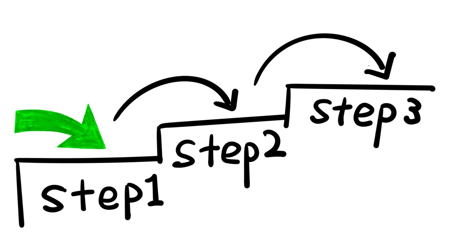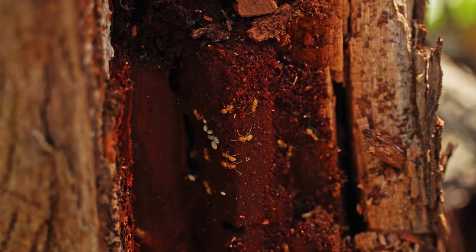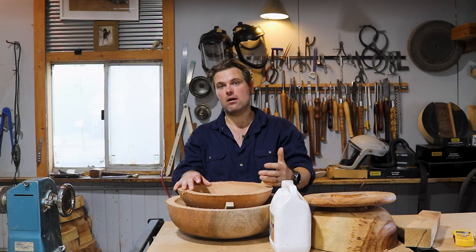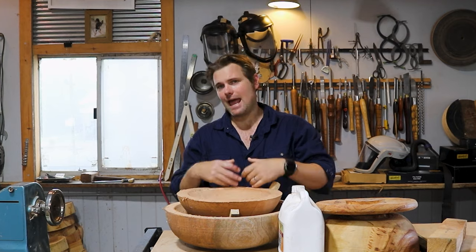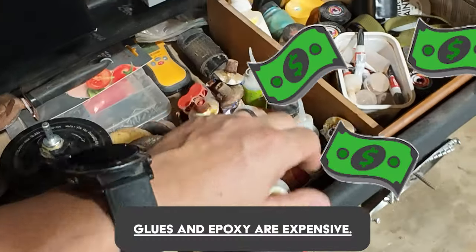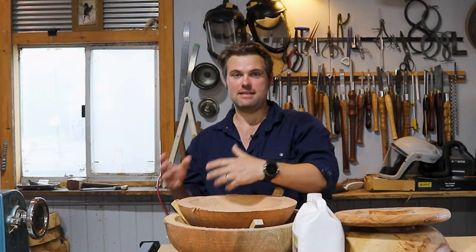When you are processing your timber you have to get rid of all the defects before you start drying. You want to get rid of all the decay, any rot within the timber, any weak or crumbly timber. Get that out straight away, along with any big knots, because trying to save every piece of timber only costs you more money down the track having to rectify those defects.